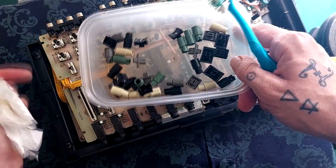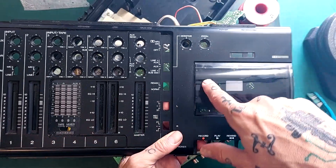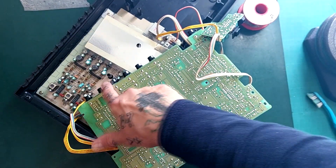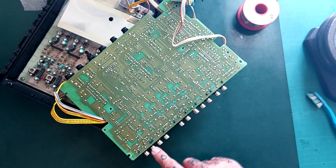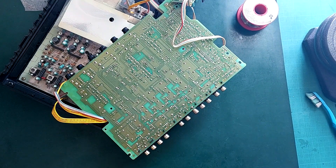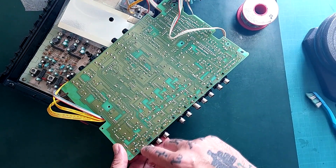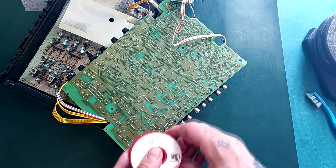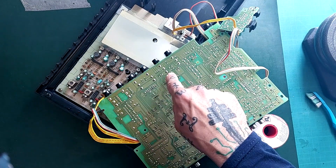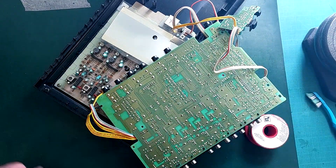Once it's been sitting and cleaning for a while, rinse it through a sieve and let it dry. If there's any liquid caught up in the parts, I'll get it off with Q-tips before putting it back on the machine. The upper case has also been cleaned with Windex and is looking a bit shinier. As a precaution, I'm going to address all these one, two, three, four, five, six quarter-inch jack sockets and eleven RCA sockets, which are mounted directly onto the circuit board. What can happen is the pressure of inserting and removing cables puts stress on the solder joints, so I'm going to heat up my soldering iron and introduce a little fresh solder - a small amount of due diligence that may save a headache later on.